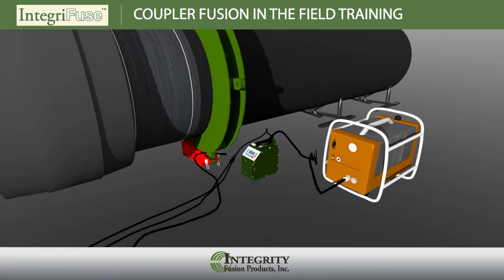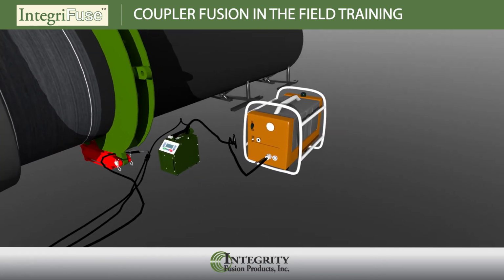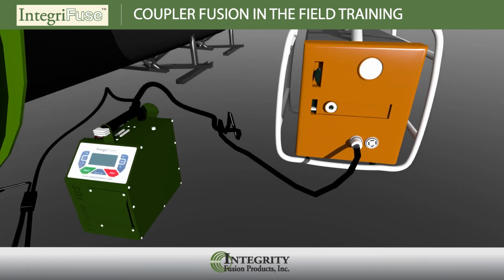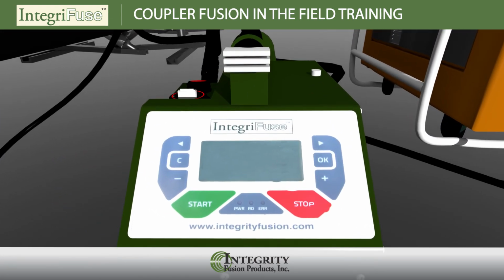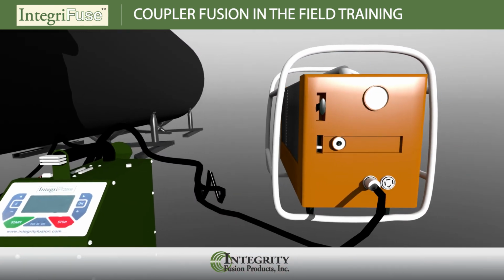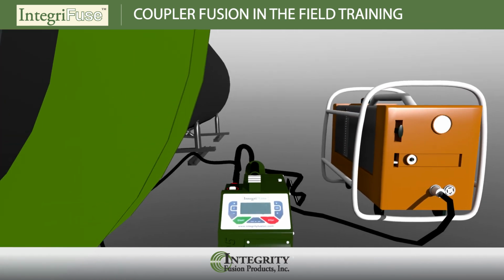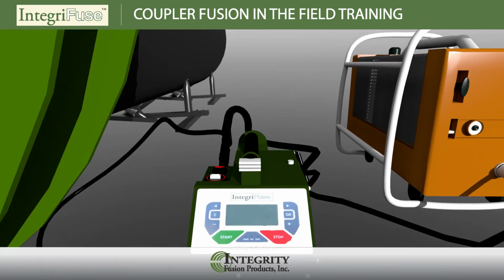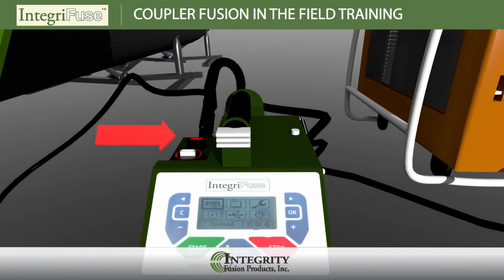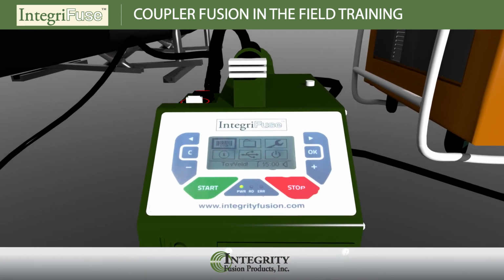Beginning the electrofusion sequence. Check your equipment, making sure that all cables, plugs, and adapters are plugged in and the lead tips are tight. Verify that the electrofusion processor switch is in the off position. Make sure that your generator is fueled, operating normally, and is running at full throttle. Turn on the processor and wait for software initialization to complete. When prompted, press Start to begin.